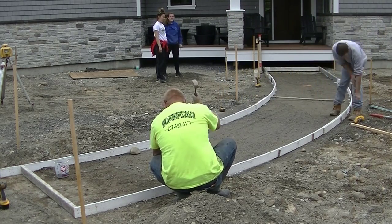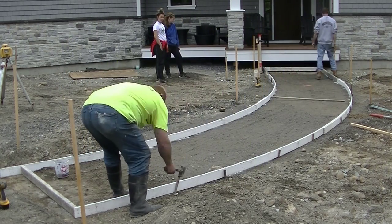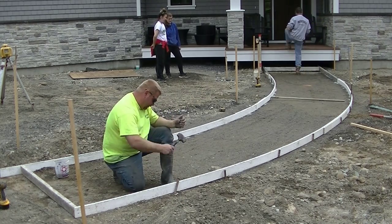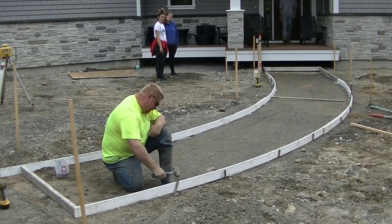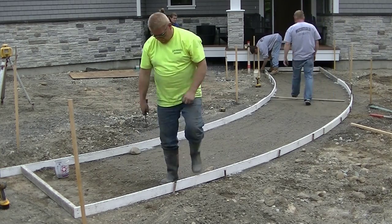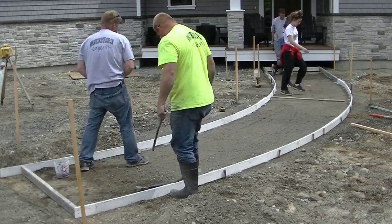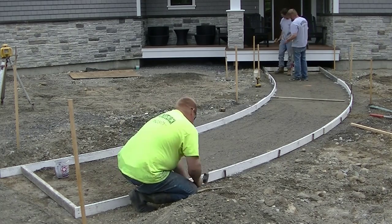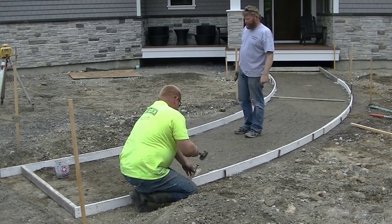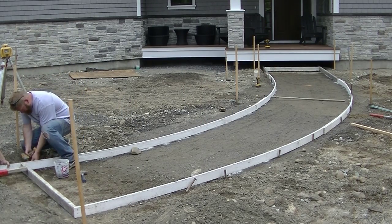Now we're getting the last few pins in and I'm up there starting to check my grades. I want to be a certain distance down on that deck so when he puts in his steps he'll have about a seven inch step on each one — and that's kind of how they graded the dirt too. I'm looking out the door to make sure everything looks good coming out the door. Whenever you're setting up curved stuff, you want to always step back and take a look to make sure it looks good by eye. You don't have to be square or plumb with something all the time, but it's got to look good by eye because that's what you're going to notice every time you look at it. So if something doesn't look okay by eye, you might want to just tweak it a little bit.